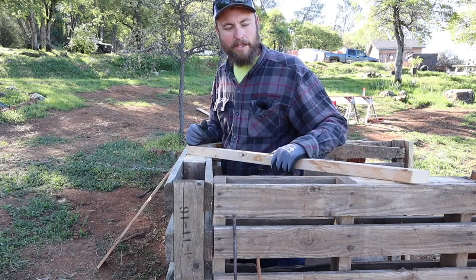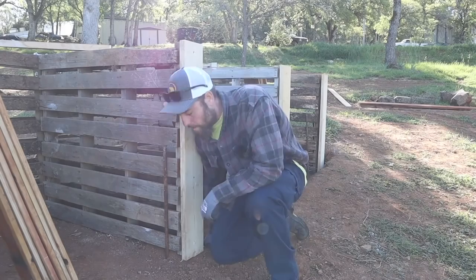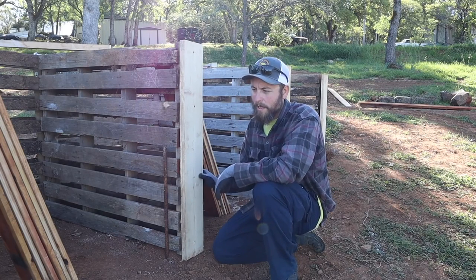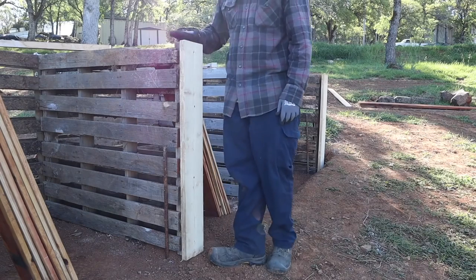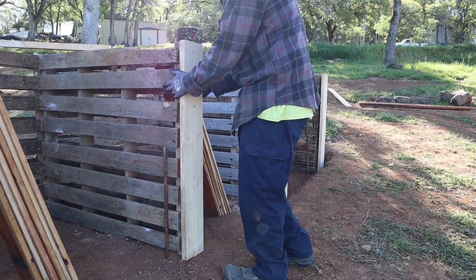It's not pretty, but it is functional and it does what it was intended to do. Now let's talk about these fronts — it's called corral lumber, really just rough-cut Doug fir. Looks pretty nice, one and a quarter inch thick. It kind of added to the rustic theme of the rough-looking pallets. Before I put these on, I added a three-quarter inch piece of redwood in between, screwed that onto the pallet, and then screwed this onto the face of that, flushing it with the edges of the pallets as best I could.